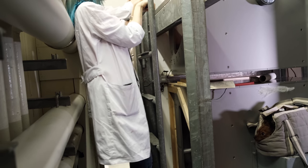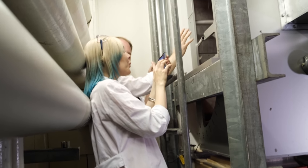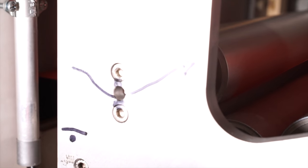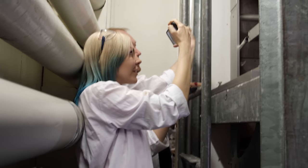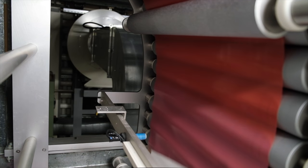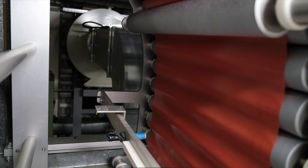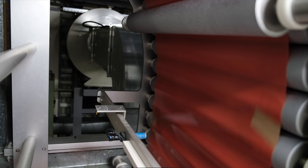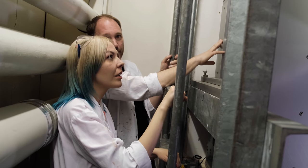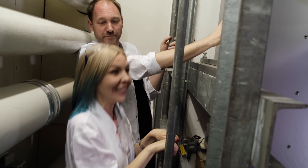When you arrive up here, you're in trouble, because the wet side of the film has to be turned, and it must not touch a roller. Because if the wet side of the film touches a roller, guess what happens? The emulsion gets scraped off by the roller. So we have to build this complex suction elbow, it's called. There's a lot of air being sucked from the back side, so that the film is sucked against these rollers, and you can turn the film without the front side touching a roller. We have two of them, and you need them every other turn. The other turn on the other side you can do with a simple roller, but on this side of the web you need something like this. Otherwise your film would be gone. I'm not gonna ask if that happened to you. No, that never happened. These were fine.